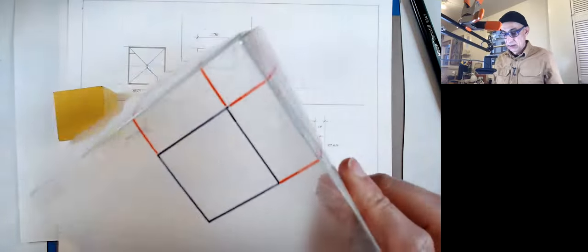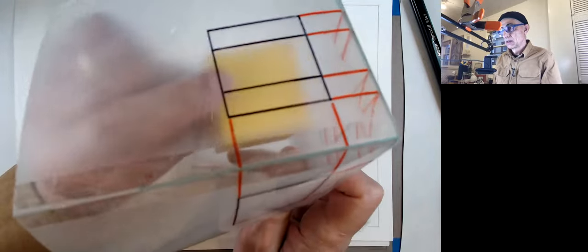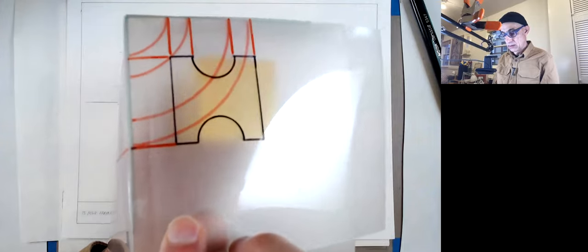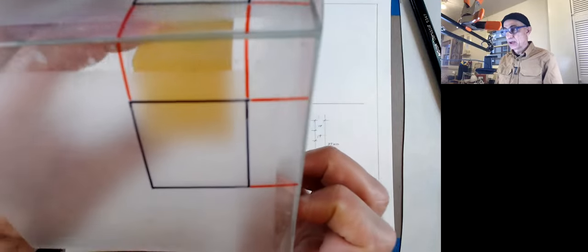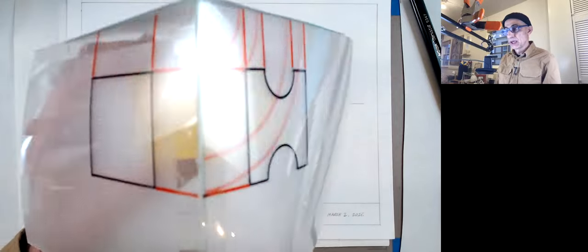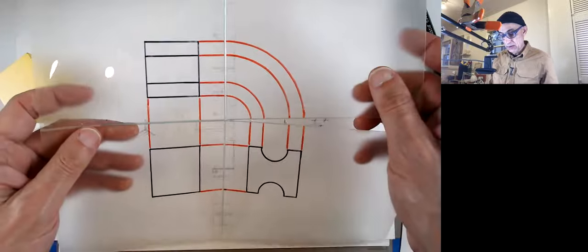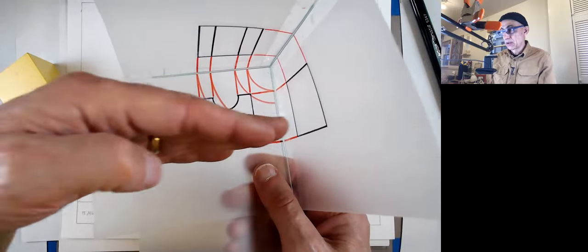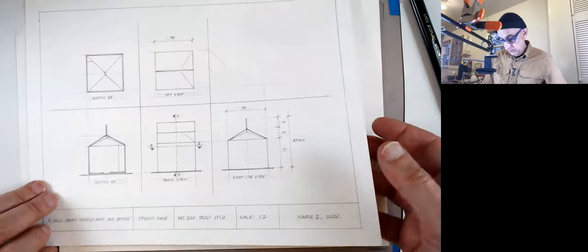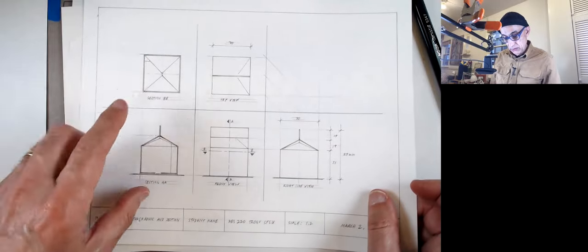This is like a glass house — looking inside I see the cube. I see the front, I see the top, I see the side. In general, if this is my front, the right side means going around to the right side. So that's orthographic projection, everything going perpendicular. We're drawing this from scratch, and then we'll also do two views which are going to be sections.